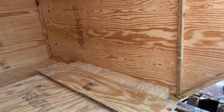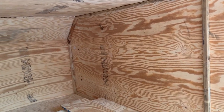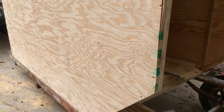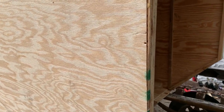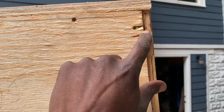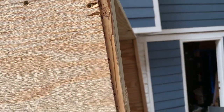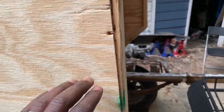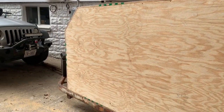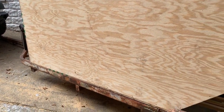I'm not a carpenter, but I think it turned out all right. There are some places I need to caulk and get sealed up. Right now I'm waiting on Brother Barry to bring over his belt sander and we're going to go over the whole thing. Once I belt sand it, I'm going to go everywhere where the screw holes are — they're all, for the most part, countersunk — and fill all that in. The next step is covering it with primer so I can put the fiberglass wrap on top.